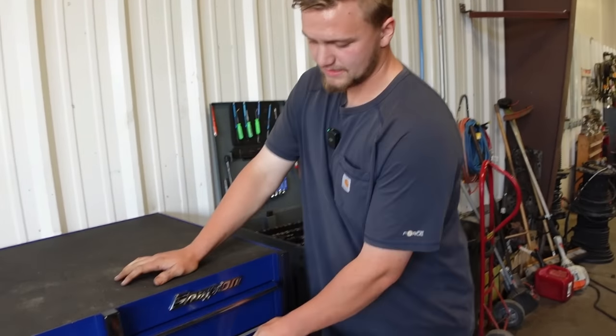These are for blowing out radiators and charge air coolers. For dirt trucks their radiators will get fully compacted on the outside. Farm trucks are the most common. I noticed you have the Lyle genie — those are nice. This one's air, yeah. This one's a smaller profile so I'll grab this water one and then that one. Some transmissions on dirt trucks get a lot of dirt on top and you can stick this behind the engine and just blow it all off before you have to get on top to unhook everything.